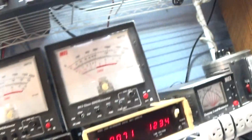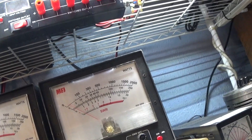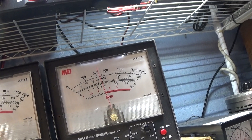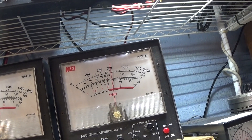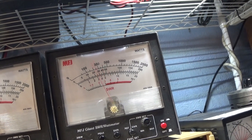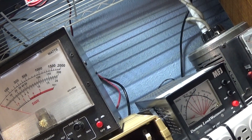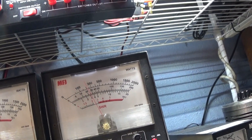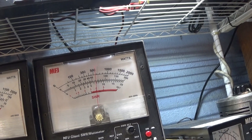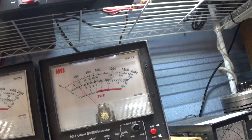On peak that's about 400 peak watts average. Now switching over to the high side — taking it off heat for a moment — and keying. Audio talking is about 350 watts, whistling to about 550 watts average with it dialed down. Over on peak: audio is about 700 watts peak, and that's clean watts with that pi-L output circuit — no harmonics or anything.